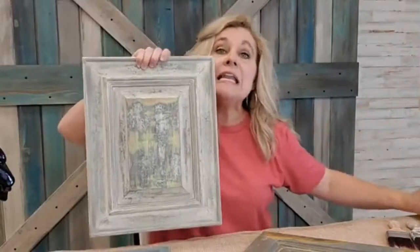I remove all of my doors and drawers when I paint kitchen cabinets. I take them to my warehouse, spray them, and they go on my drying rack. Now, that's not necessary — my friend Lisa in Alabama hand paints everything in place and that works great too. Whatever way works best for you. I pull all my doors and drawers and paint them at my warehouse; they lay on my drying rack for seven days before I reinstall them, because I like mine to be seven days into the cure time before reinstalling.